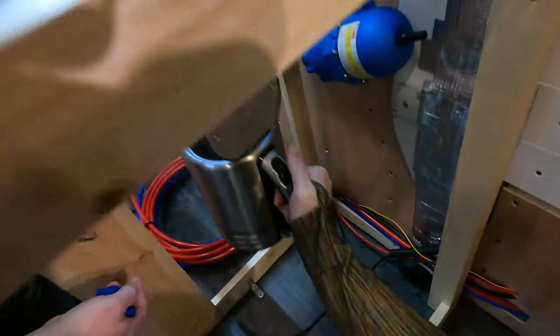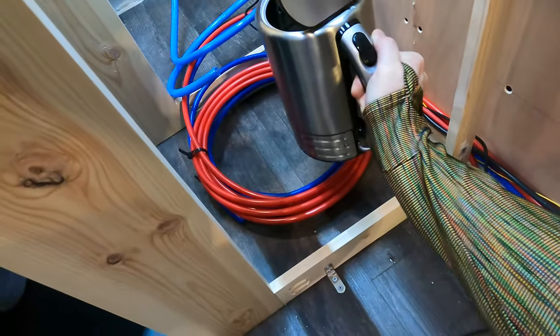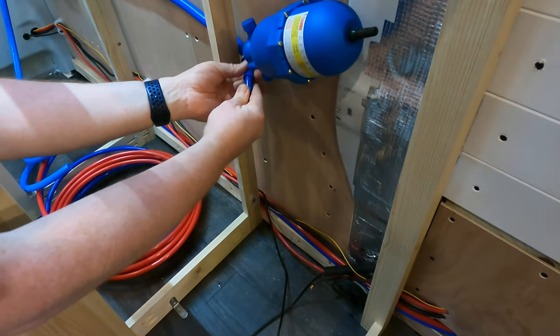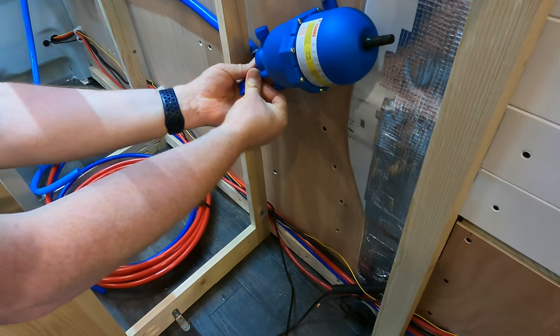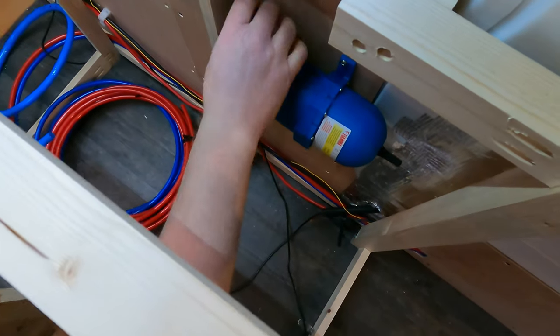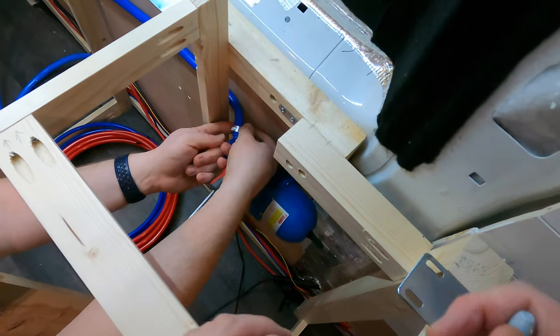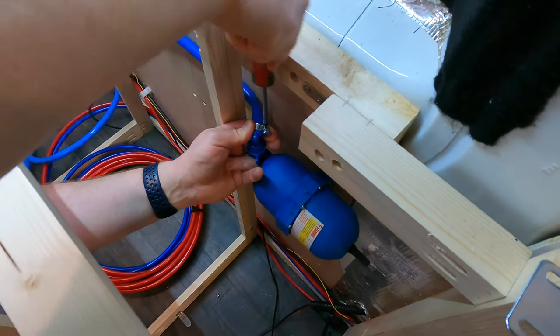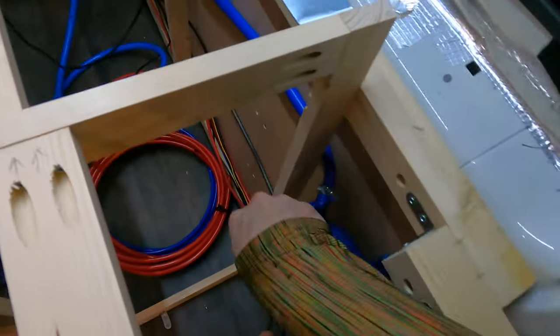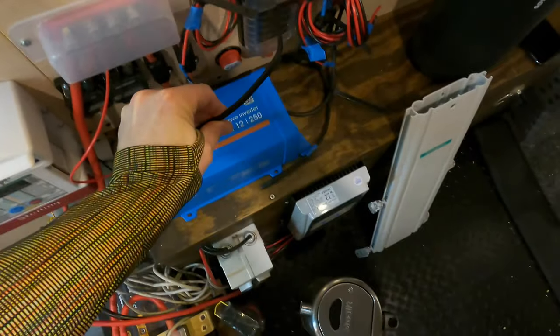We were listening to music while we did this, which YouTube would have just removed, but at least that gives me an opportunity to explain what's going on. So here we were just heating up the pipe to connect it to the accumulator to let us test whether we were all watertight. So this is the feed that the pump pulls from the water tank into the accumulator, just getting that tightened up, and then an electrical cable for the pump, which we wired in back here.